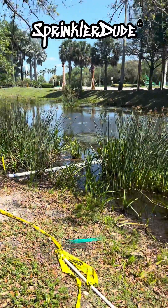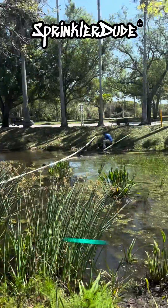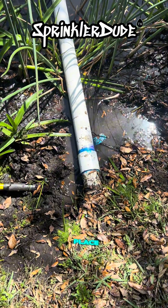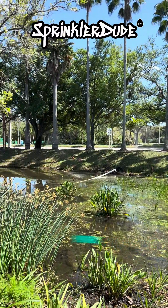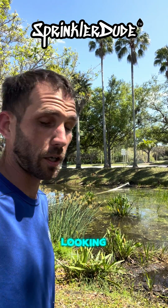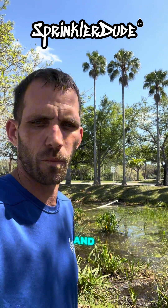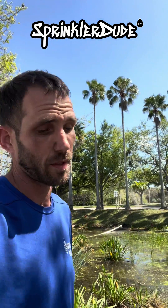He's going to use a couple of 90s to get that last part together because of the water in the middle. We can't really work with the pipe the way we would want to, so we're going to wait until this water is dried up later on this year and redo that connection. If we didn't do this, none of the irrigation would work on that side of the retention area because this is the pipe supplying water to that entire side. The zone is working. We're going to cut that 90 out when the water goes away, but for now it's on and working. We'll come back when this is not full of water and put it back together straight — but until then, all these palm trees and turf are getting water. On to the next one.